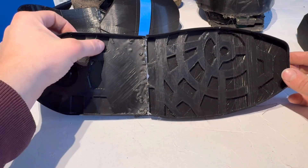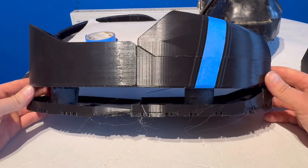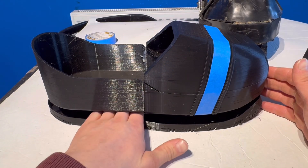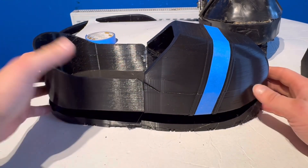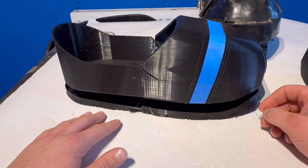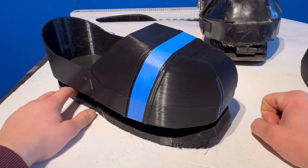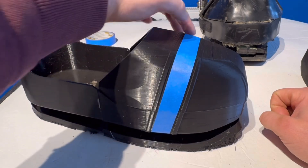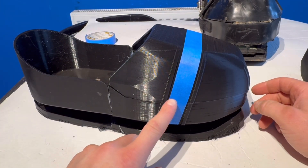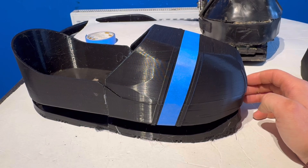The tread is only 5 millimeters deep so it shouldn't get stuck in any gridded steps or stairways. I've now mounted the sole on a couple of little pieces of foam to show the clearance it will have, allowing the exoskeleton ankle frame to fit in that gap for rotational movement. On the actual armored version it'll be mounted on rubbers packed out with foam like the previous prototype. I've also got tape that fits nicely into the ridges to show how the velcro will sit — I kept the ridge line at around 30mm for the velcro strapping as it needs to sit well on the curve of the boot.